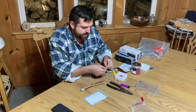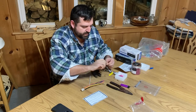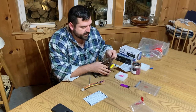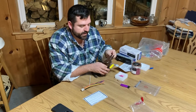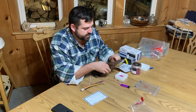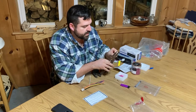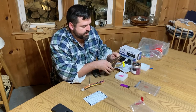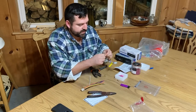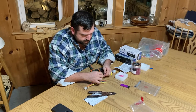Solid crimp connection. We're going to trim this down a little bit because you don't need an inch of wire. Typically, you want enough to go to the center of that crimp. It's just about a quarter of an inch of wire sticking past. I should have brought my better snips, but these are what I have. This thing's done a few different projects, including household electrical, and it's cut some wire I probably shouldn't have cut. So, black to black. Done.